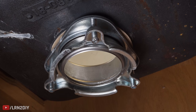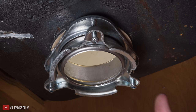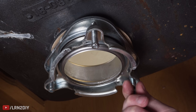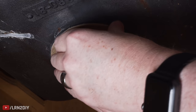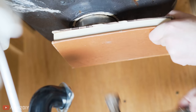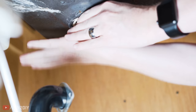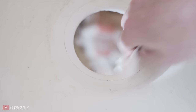Removing an old setup like this is typically pretty easy. We're going to remove these three screws here, then pop off the clamp ring that's underneath, and with that off we can pull the two flanges down and pop the rest up. There it goes. There's old plumber's putty that's been sitting in there for decades, so it's time to get that out. Make sure the top side is completely cleared off so that when the new flange goes in it forms a perfect seal.